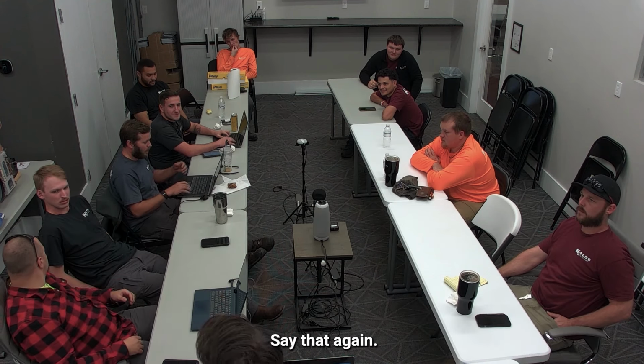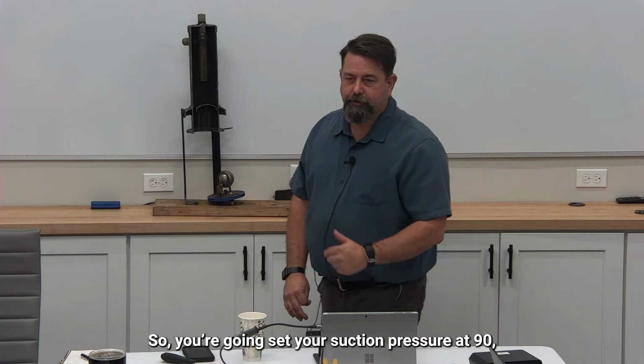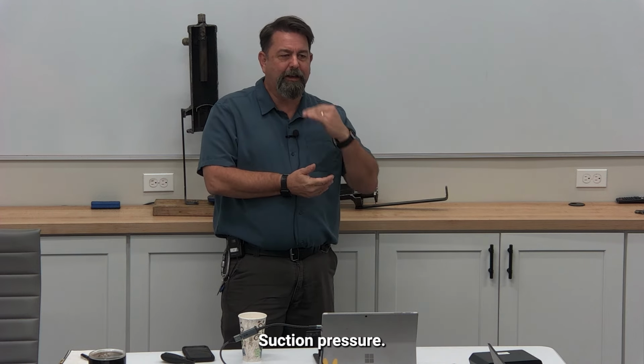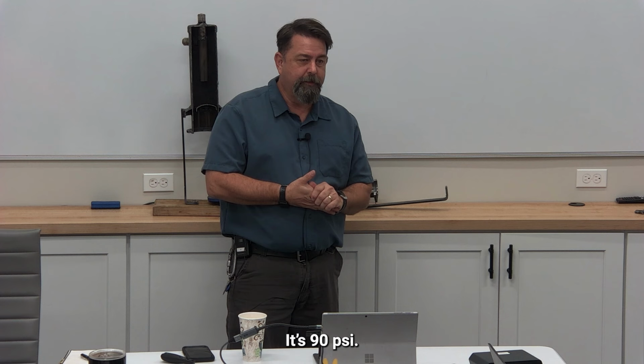Say that again? At a minimum. So you're going to take suction plus 90. That's where you're going to set your holdback. Let's say I'm running a 20 PSI suction on my rack. I'm running 20 PSI, I need 90. That means my minimum discharge pressure can be 110. Oh, so it's just like setting the stages off for an EPR. Sounds pretty similar, right? So 110 would be the absolute lowest I could possibly go.